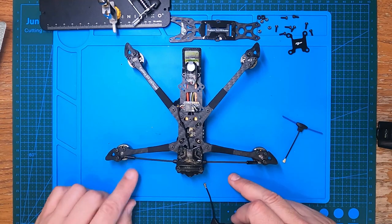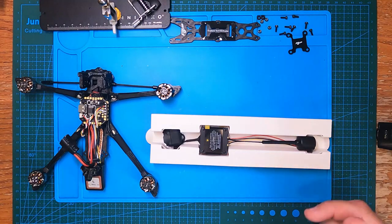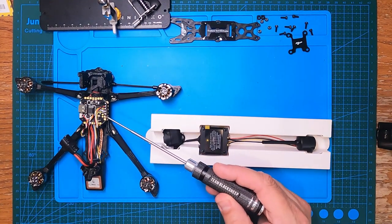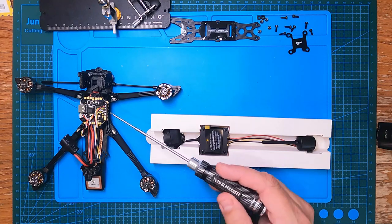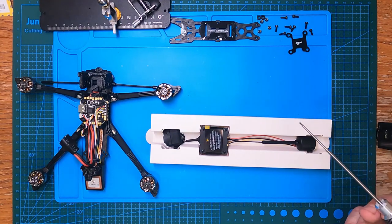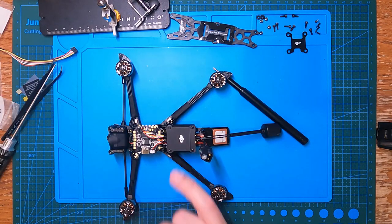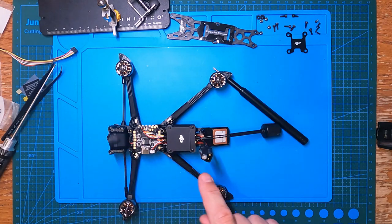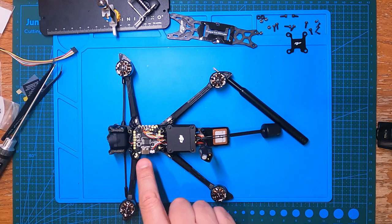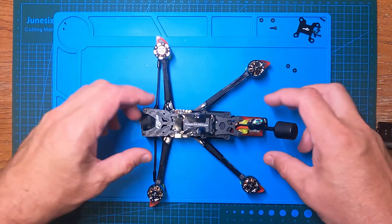One of the final parts is installing the DJI O3 air unit. I did my homework and double-checked that the flight controller's BEC — both 5V and 10V outputs — are rated at 2 amps, confirming at Madstech and other reviews that 2 amps is the minimum. I've routed the camera cable between the flight stack and looped it underneath the ESCs at the bottom, giving lots of space for the camera. Here's the unit installed with new colors — a nice model upgrade.